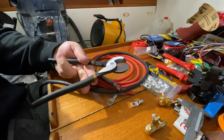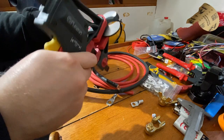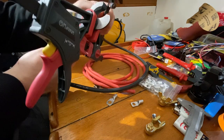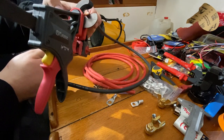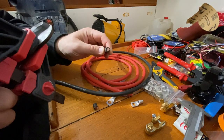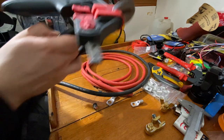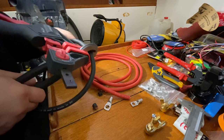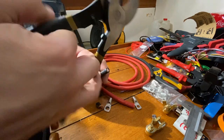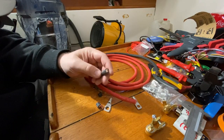As a do-it-yourself guy, I invented a workaround. So let's take a clamp and squeeze this up so that it holds together. You can still move it, and let's try to make another cut here. Like so. Lesson learned. If you do a lot of big cables, get a good tool. Another tool I don't have is the proper thick wire sleeve cutter, so I'm gonna use the same tool. These are quite sharp and this is the kind of sleeve that cuts quite easily.